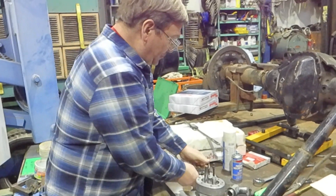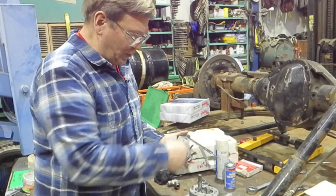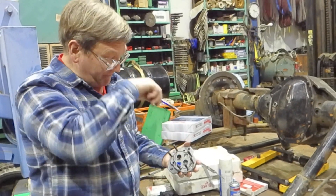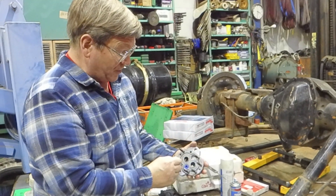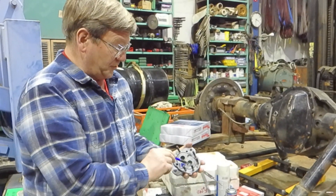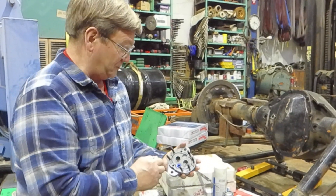There's another version of this pump that they make, regardless of brand. There are two plugs generally for rotation. Sometimes you might even have one that doesn't have plugs — it just has a hole drilled over here, no hole on the other side. You take a drill, drill it a little bit, put a 1/16-inch pipe plug in there, and then you can drill a hole from the other side. Again, you can reverse the rotation and do some things it wasn't meant to do.